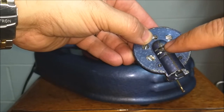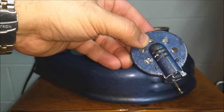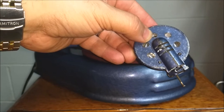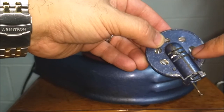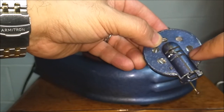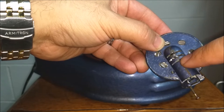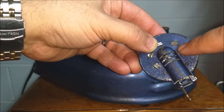Well, somebody had the aluminum diaphragm put in and then a bunch of tin foil pushing the needle bar against it. Yeah, I've seen it all. Luckily I had a few spare aluminum diaphragms, so I replaced the diaphragm.